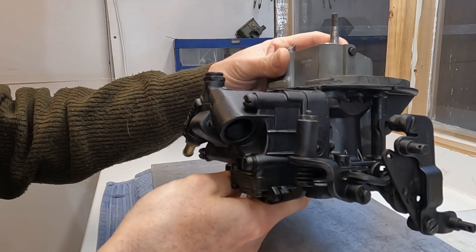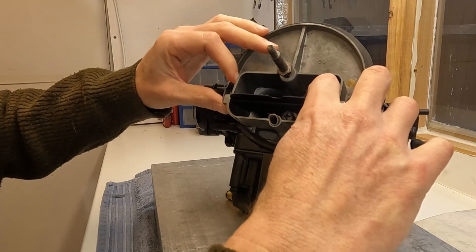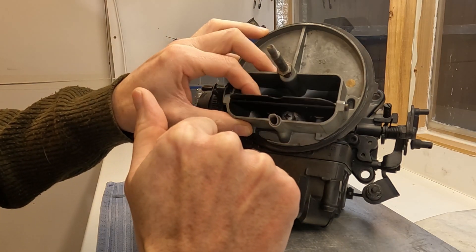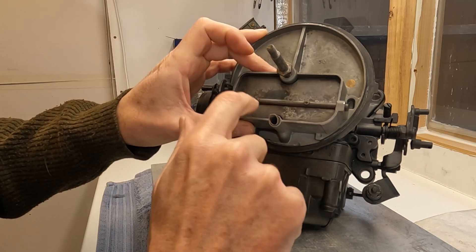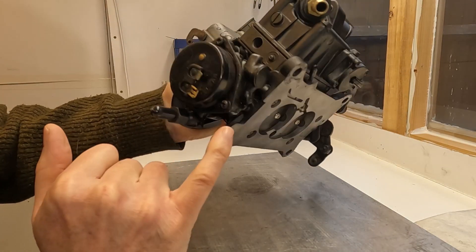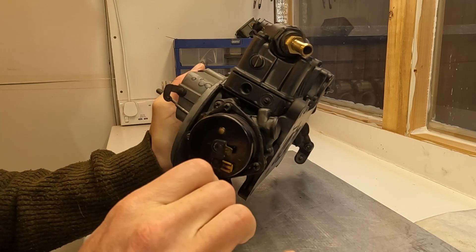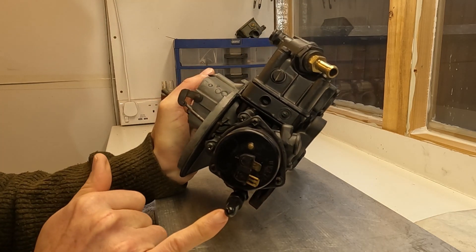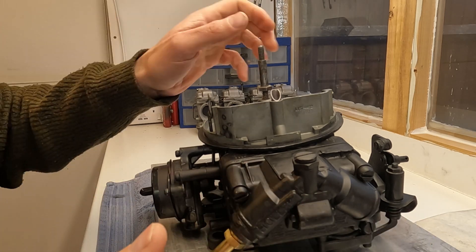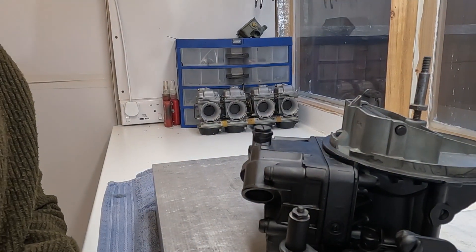This is quite important in marine carbs of this type. I also did the chemical blacking for the choke flap and choke shaft, which can be subject to corrosion — this gives the unit a longer life. We've also redone the choke: the original had a connector for external vacuum, but now it's going to rely on internal vacuum, so I've put a vacuum cap there. This unit is now ready to go and be pressed back into service.